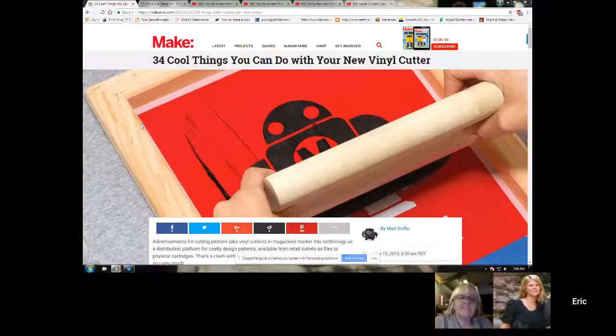So very similar to a laser cutter, you're able to get a high level of precision when cutting through material, but you do need to have a certain amount of understanding of the way that machine is going to work when deciding what materials you can and cannot feed through it. My number one recommendation and my caveat, because I work in a lot of shared community spaces: please bring your own blades. If you are going to be using these machines for something other than they've been intentionally designed for, you may put a lot of wear and tear on them, and bringing your own blade will increase the good graces of the operations manager of whatever facility you're working at. And sometimes when cutting through these materials, you can take chips and dings out of the blade, which will cause issues for whoever's using it afterwards.